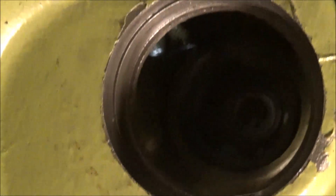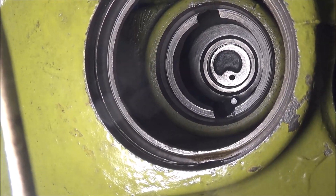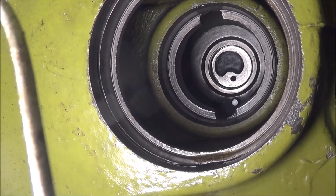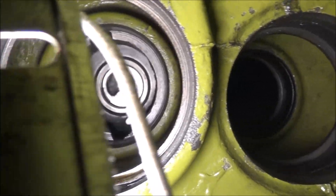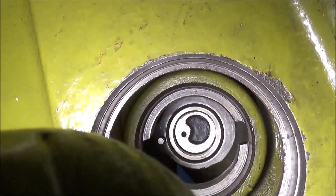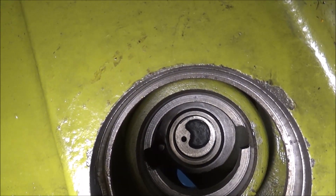You can see there's lots of boring mill work in here that's been done. This one up here - that's the problem child. All the way back in the back where that hole is, that's where the hydraulic oil comes out and pushes on the piston. And that bore is a little turfed up there. Doesn't look aligned in this picture but I can't get the camera up there to line up on it. Anyway, that's where we've got to work, way back in there, and it is a blind hole.